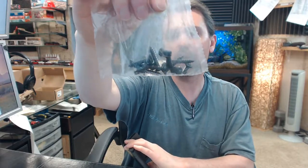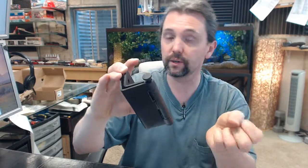Screws are included — you are going to get this package with all wood screws and all metal screws, which is atypical; you usually get all metal and half wood. Options on this sort of hinge include different sizes and decorative tips — it would be unusual to have anything but a button tip, but you could put an urn, ball, steeple, or acorn tip on it. Security features are very common, such as turning this into an NRP non-removable pin hinge. If it is an exterior door that swings out, you will want a non-removable pin so the pin cannot be driven out once seated.